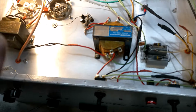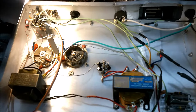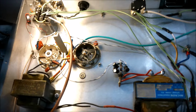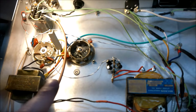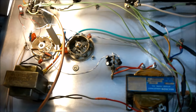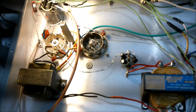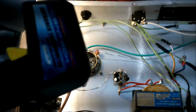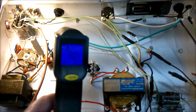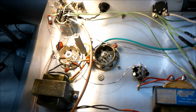Okay, so we retested the tubes. They tested good. Still making 5 1/4. No signs of a flashover inside the tubes or anything. We tested the high voltage, we tested the doorknob capacitor, then we tested with our handy dandy thermal gun the temperature of the tubes, and they weren't getting hot. So,